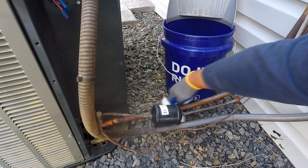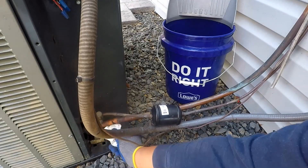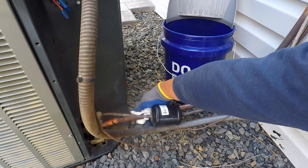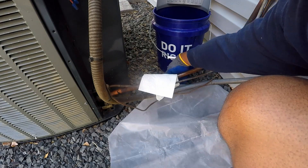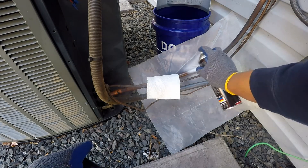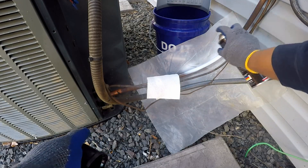The lines need to be cleaned and a little more preparation before the maintenance can begin. Cleaning in this case is as simple as wiping off the lines with a paper towel. I also put down a plastic sheet to prevent overspray of the insulation. After shaking the cold pipe insulation can for over 2 minutes, I began to apply the insulation.